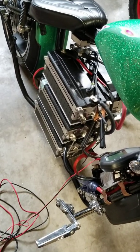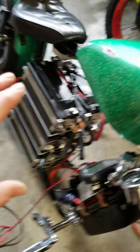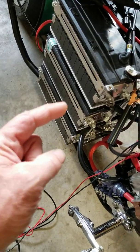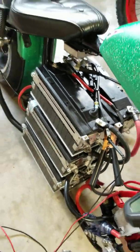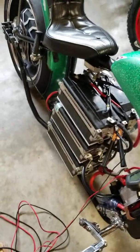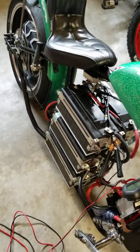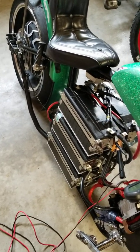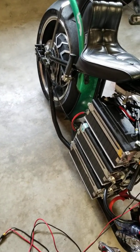They do come as a single cake, so you get a full square. I have three of them here — one, two, three — and they're just flat squares. They're two packs, so that's one brick. You can run them as a 32-odd volt per side, or you can run them as a 64-volt block. That's 20 amp hours each, so each was 20 amp hours at 64 volts, giving me 60 amp hours at 64 volts.